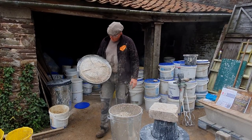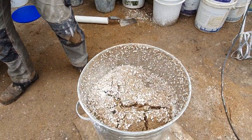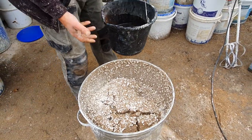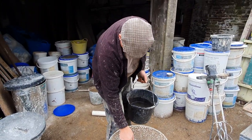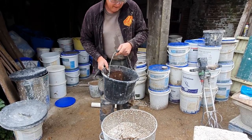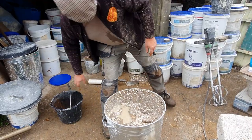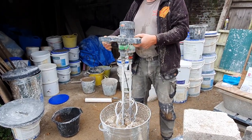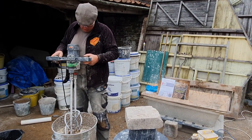And whilst that's cooking, here's one that I've done literally 20 minutes ago. You can see that's swelled up — it popped quite nicely and it's blowing bits of quicklime up through. Those sort of started off at about 4mm, so they've already started expanding. They look like lumps of gravel and they're already soft. It's nice and hot. So you want a little bit of water just on the top, and we mix from the top down because we don't want to let the heat out too quickly — we want to keep it trapped under the wet mortar.